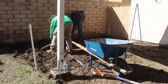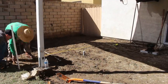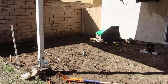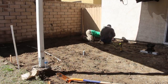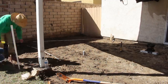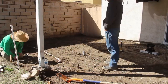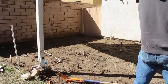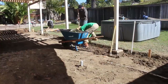You can literally do the math for this job: three inches divided by 13.5 feet. You convert the three inches to feet — 0.25 — divided by 13.5, then times 100, and you get just about two percent. I think it comes out to about 1.85%, which is actually better because it's a patio — you don't want too much slope.